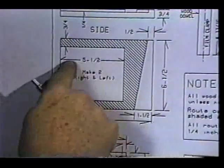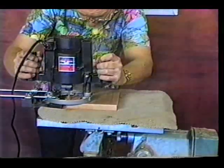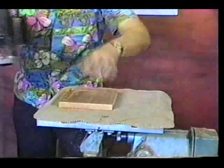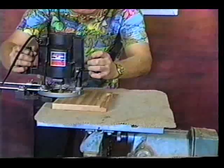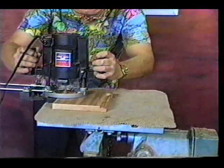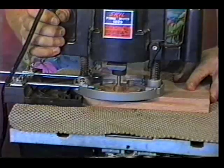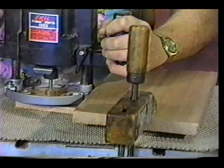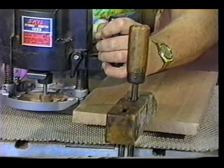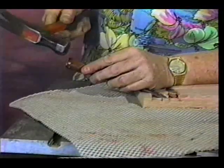The inside is five and a half inches — that's the focal length of the camera — and we're laying out that so that we can route it. We have a little rubber routing pad that holds the wood stable while we do the routing; if you notice, we don't have to use any clamps. This is a unique arrangement and makes the job a lot easier. Now we're cutting that five and a half inch depth. We did the two sides at three-quarter inch from the same cut as the top, and then this is the angle cut.